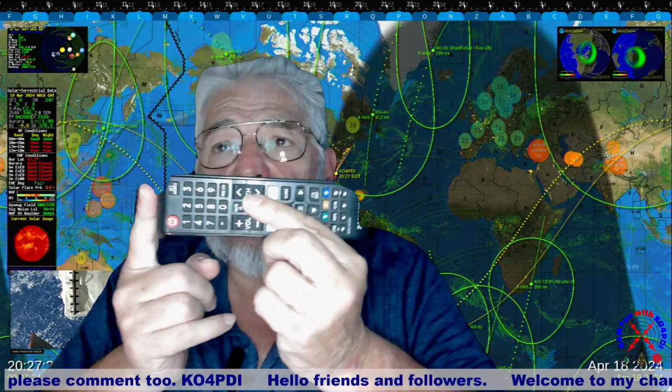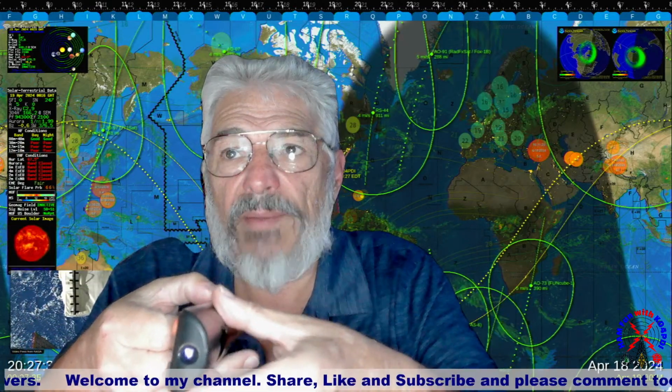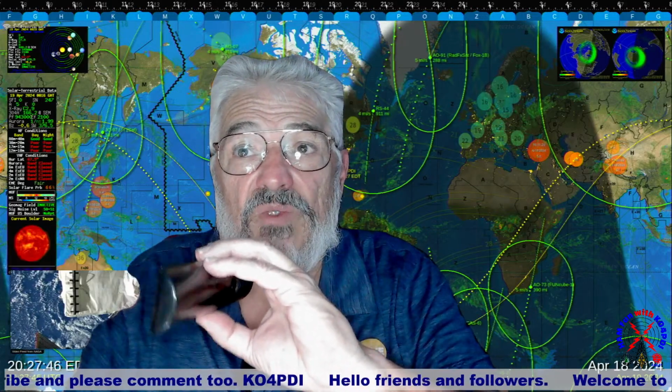And yeah, the reason I probably sounded weak is I try to explain this every time I do RS-44. If this is the booster, the satellite's at the end, and it's still on there and the booster is still connected. If it tumbles like this, when the booster is between me and the satellite, you're not going to hear it. You lose the signal. As it comes around, you start picking up the signal down here, and as it gets closer and closer, that's when you heard it getting really loud, when it was pointing right at me. And then it keeps going and comes out of the direction. I can't see it anymore because of the tumbling booster.